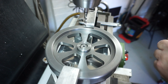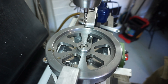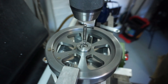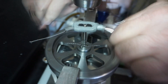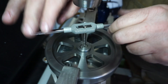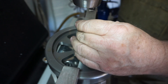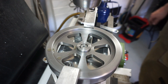This is a spiral flute tap that I predominantly use on my CNC. I like using spiral flute taps as they pull the swarf up out of the job rather than shoving it down in the hole. I'll start it up and then just turn it off and hand feed it — hopefully I don't snap the tap. Look at that — like a hot knife through butter. I'll get a tap wrench on it now and give it a bit of a tap, sneaking up on the bottom. I don't want to force it and snap it off in there.